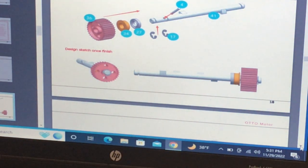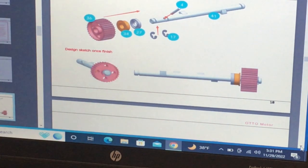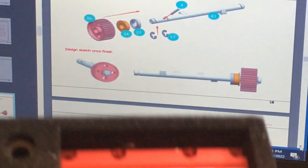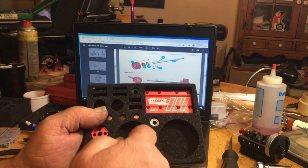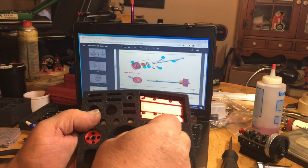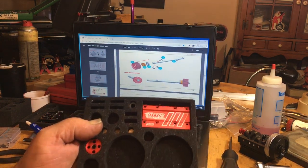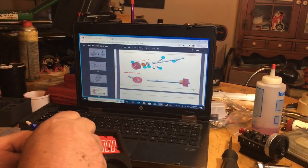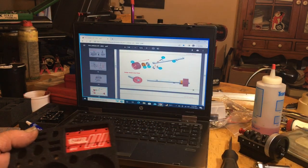Now, we'll get the camshaft out. Okay, 34, 27 and 17s here, all right? Now you're going to look in your blister pack here. I'm going to zoom out. There's two flange bearings here next to where the starter pulley and the flywheel were. I'll put them down here, and I'll show you guys how they are in a second. And up here is your cam seal right next to the valve cover. This is the seal you're going to need for the front, which I believe is 27. There's two of them in here. You want one for the front, one for the back.